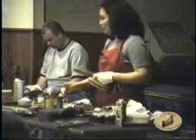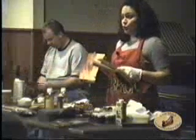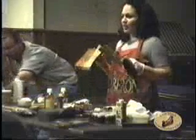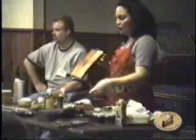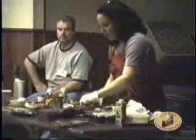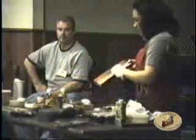You can, right. If I was very happy with this color, and this is exactly what I wanted, I would go with the neutral wax. Neutral, because clear again has a little bit of color in it. If this still wasn't what I needed, I could use a mahogany wax, and that will just impart a little more warmth. This is a Victorian mahogany, which is a little more red. And again, on the wall, it's a little different, but there's also Georgian mahogany, which is very brown.